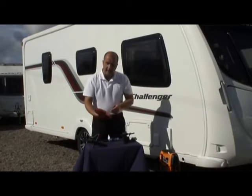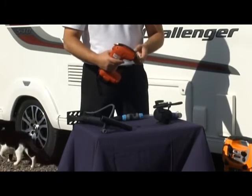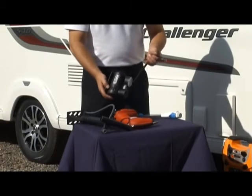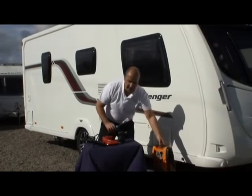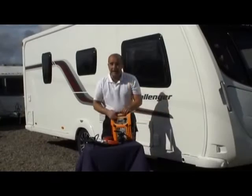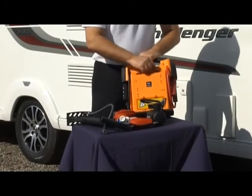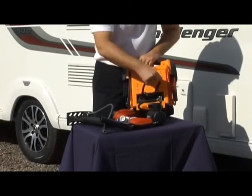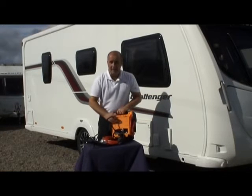What we also have here is a handheld little pump, where if I were to press on the key, it acts somewhat like a cordless drill. It will produce air also. You've, I'm sure, come across these before, which is a typical 12 volt compressor, which you could plug into the cigarette lighter of the car. One that I use here is a 12 volt battery pack. Now what it has is jump leads on the side, and it's just a handy thing to have around. But the one thing it does have is, if I turn it around, it has a digital compressor. There's a digital reading here, and I can set the pressure that I want to put in. At the bottom here, what I also have is the valve connector. So I just connect that onto the end of the device, set the gauge and turn the compressor on.